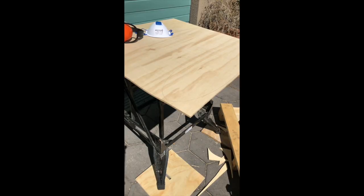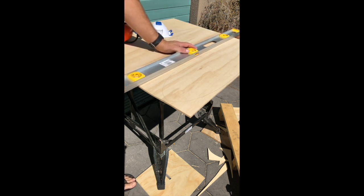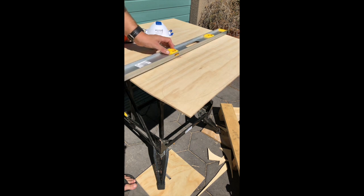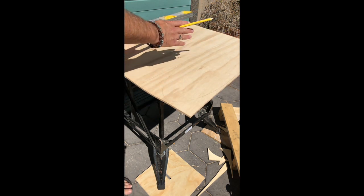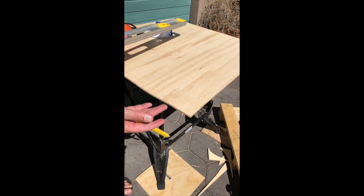Make sure the lines are relatively dark so you can see them. I've also just double-checked the measurements of the board to make sure it's nice and even and I have a centre point. Before we start cutting we need to go to the edge — I'm coming in about 1cm (10mm) from the board outline and then I'm going to rule a straight line using a straight edge, then cut along that to have a smaller piece of plywood to work with.